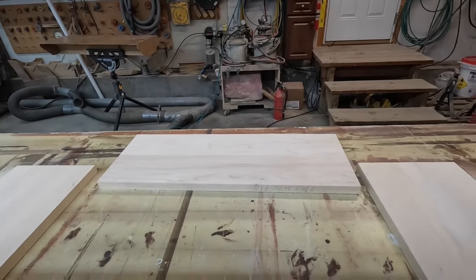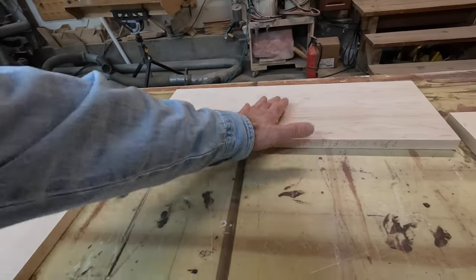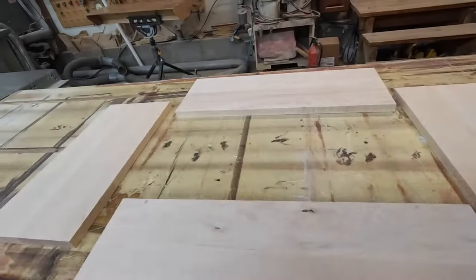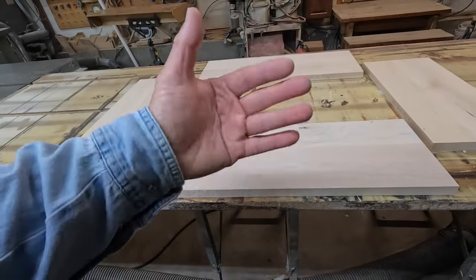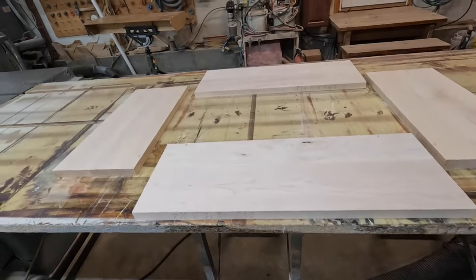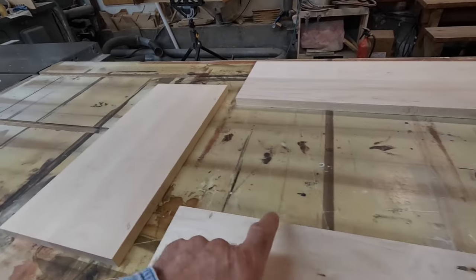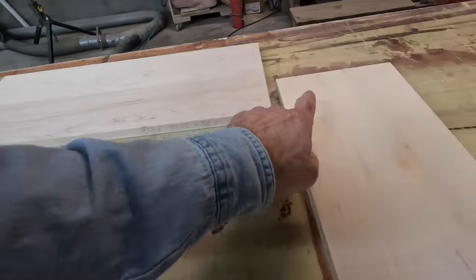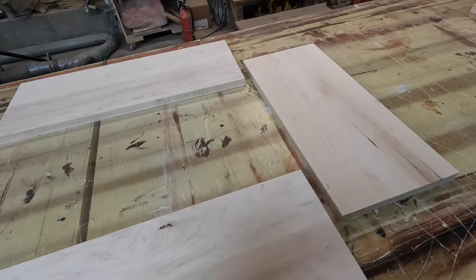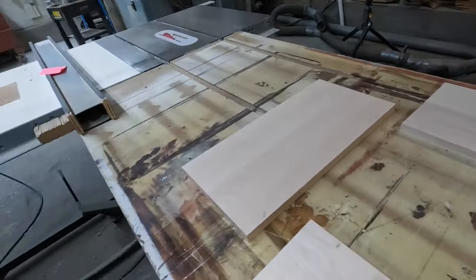When you place all your pieces, you make a drawer and explode it — lay it out flat so you have front, back, and two sides. You orient this standing in front as if this will be the drawer you pull in and out, so you get oriented properly. Then you go around and mark the very front piece A, the side is B, the back is C, and the other side that's left is D.